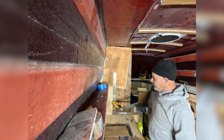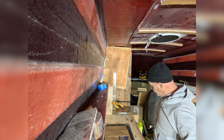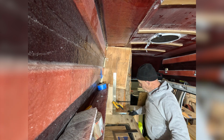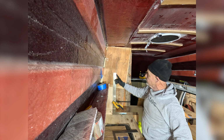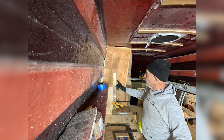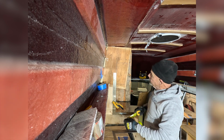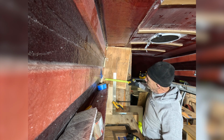Like I say, nothing is level, so I always use square. I know this is square with the floor, and this is when I go with it, and everything is square. So then all I do is take my framing square, put it up, and find out where I want the face of the cabinet, or at least the rough, because I can always stack it out with an inch, or 3/4, or even another piece if I wanted to come out more, but trying to get it close, so I just have to put a piece of 3/4 face frame. And so I decided that I want this bottom cabinet 9 inches, or 8 3/4, or 8 1/2, whatever. That's a good depth on there.